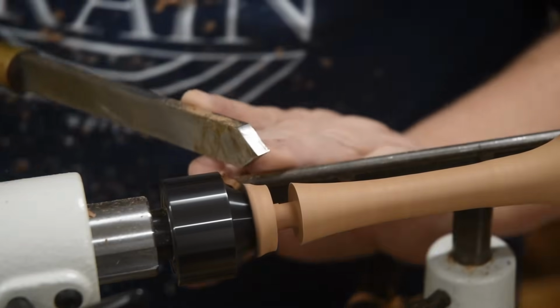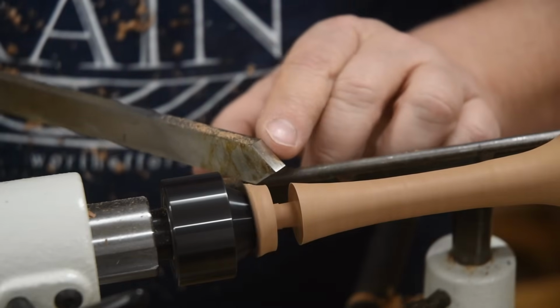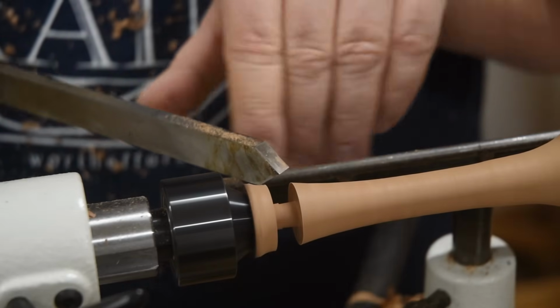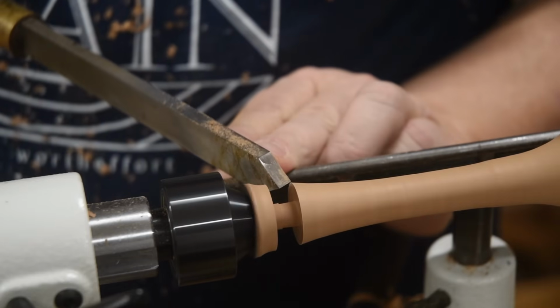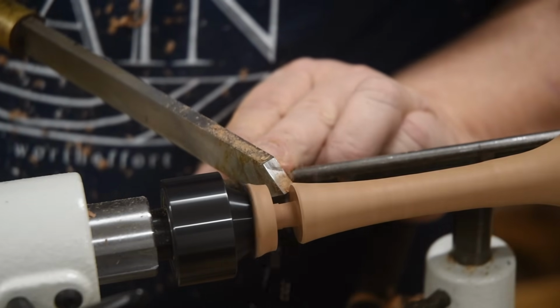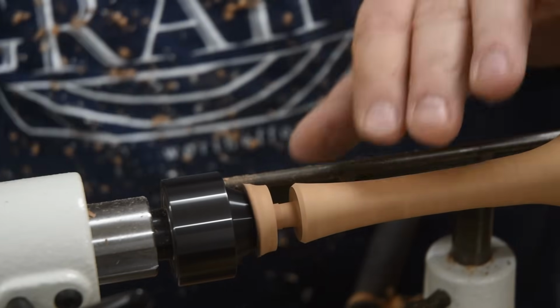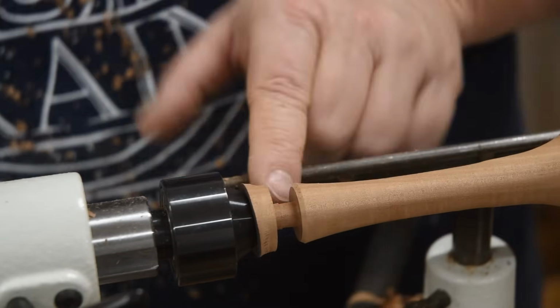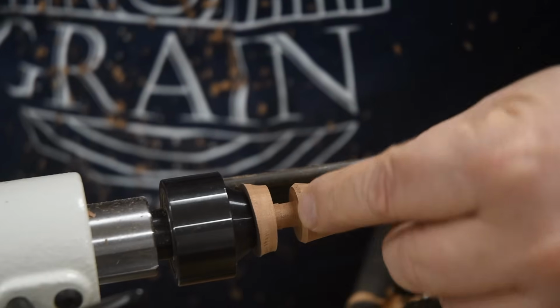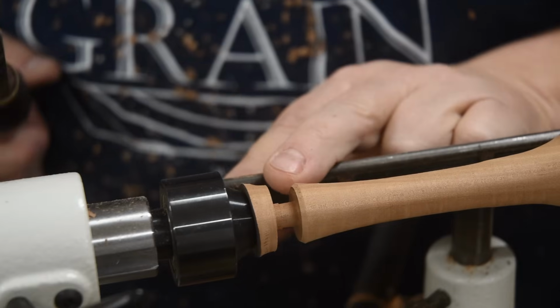Now, if you want to do something a little advanced, you can put a little bevel right there. Notice how this top edge is now at a negative angle. We discussed that earlier. I'm just going to lightly touch that corner, and we're going to scrape it. Voila, we have now created our endstock and a bevel. There might be some tear out on that face because this is a peeling cut, but we're just practicing.